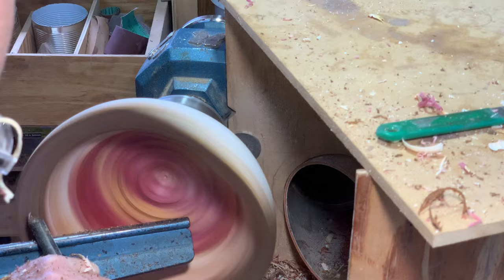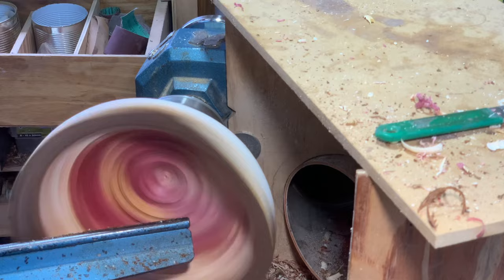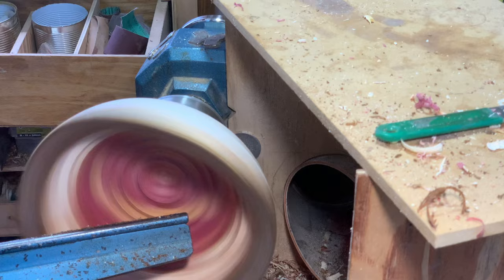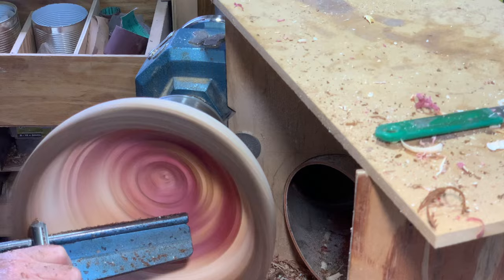Get below the rim of a clean cut so that the rim is going to look even thickness, just a shade low on the rest. Exact rest height really depends in part on your height in relation to the center height of the lathe and the tool you're using.